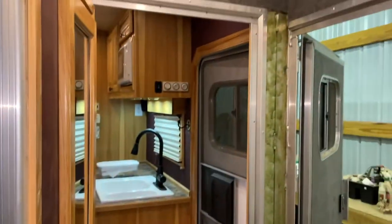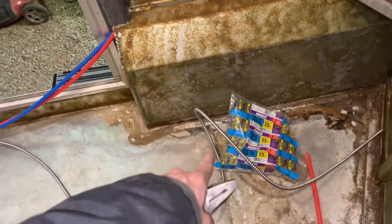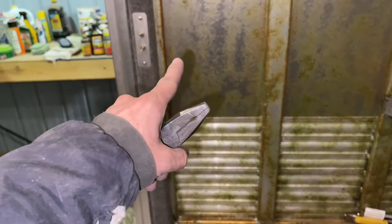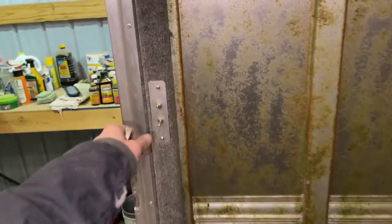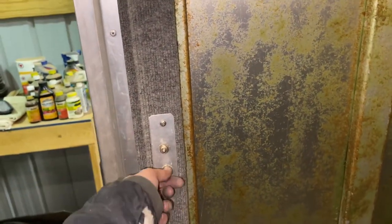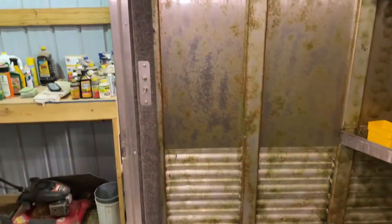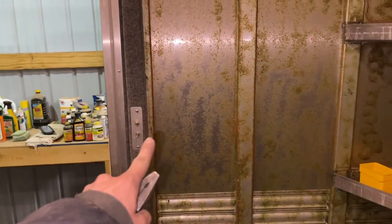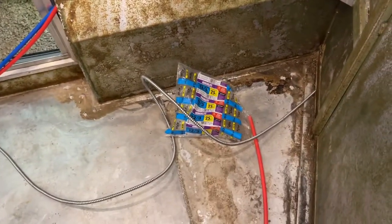Take some of this carpet off this wall. We got that carpet off. Going to bring the electrical up here. We'll have an AC switch next to our DC switches. So our interior DC lights, an exterior DC light, that'll probably be like an awning light or something. And then have a switch for the vanity light and a GFCI so Mom can run her hair dryer. And we've got more than enough wire to do it.